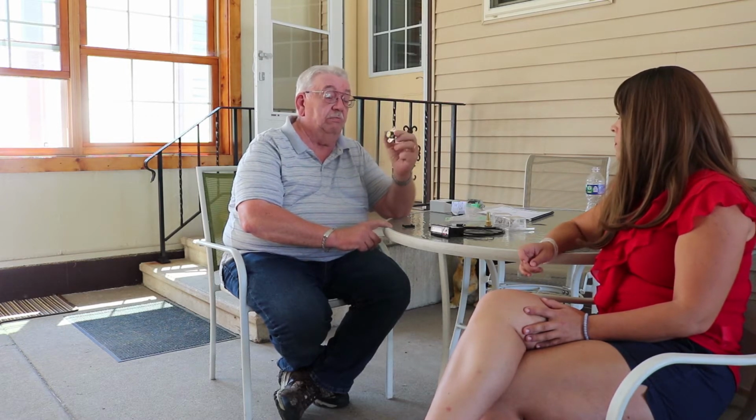This has to be installed on the stove for UL, because that stove has been UL certified, and that has to be in there. This has also been UL certified. So you never bypass it to keep the stove running, but you could bypass it to check and see if it's the switch that's causing the blower not to function.